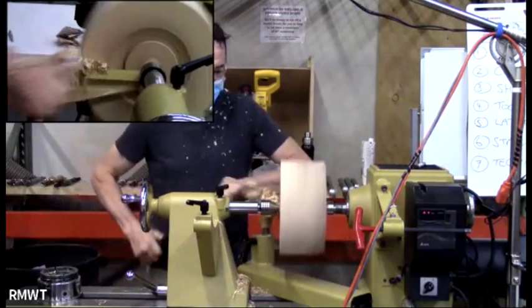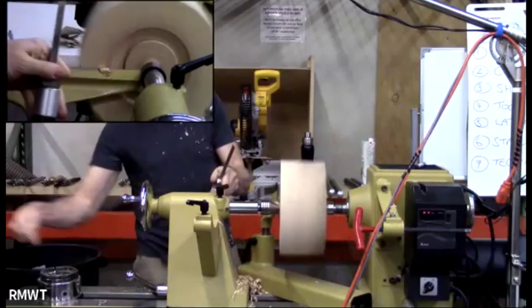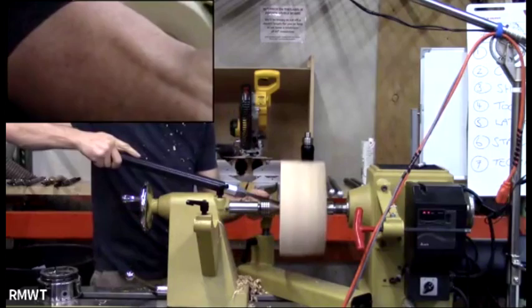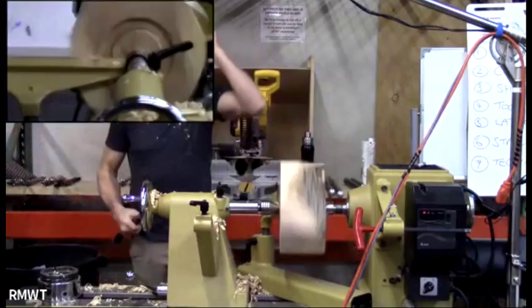Now I'm going to take a little scraper. I just got a little boring old 10-degree scraper. I just put it in front of the camera. It's just a 10-degree angle, which matches the dovetail on my jaws. So I'm going to expand into a dovetail. This is not a fun, easy cut. It's easy, but it's not fun. Just pushing in, scraping. Just a little undercut there, and enough space for the jaws. That's it. So that's how I prep my blanks for my bowl turning.